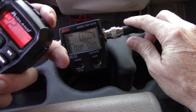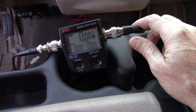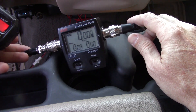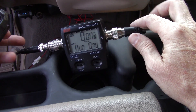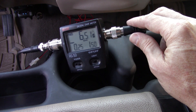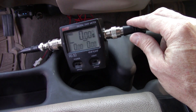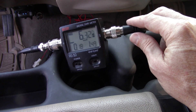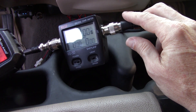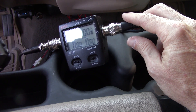Let's change it and go up to channel 1, which should be in the 462 MHz range. At channel 1 it's reading 1.47, which is a little bit high. Then checking channel 15 and Simplex channel 22 - those read about 1.49. So on repeater channels it looks like it's about 1.2 to 1, and about 1.5 on Simplex.